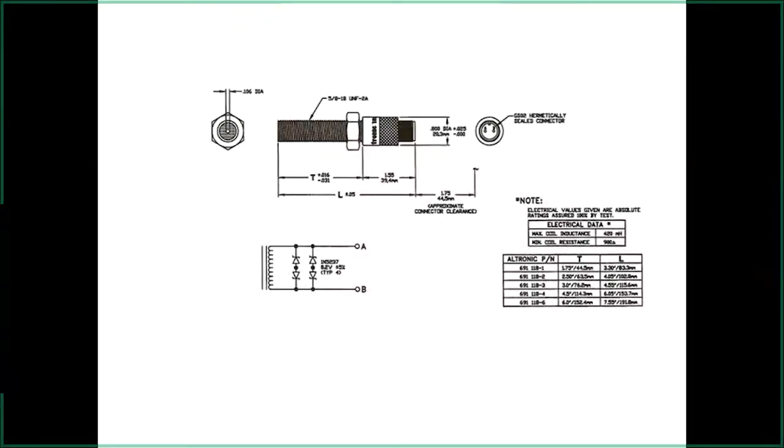For pickup resistance: older pickups ran around 900 to 1,100 ohms; the newer pickups over the last four to six months are now up to 1,500 ohms. The most important thing is to verify continuity through the pickup across both pins, and confirm there is no continuity from either pin to the casing of the pickup, to make sure the pickup is good.